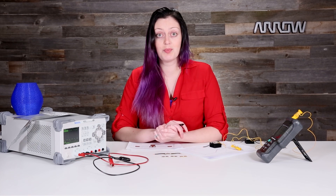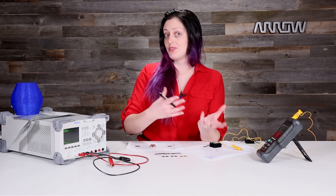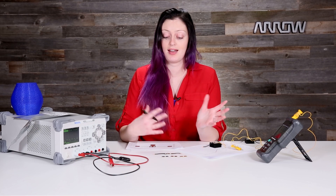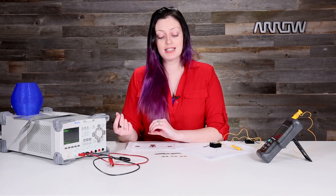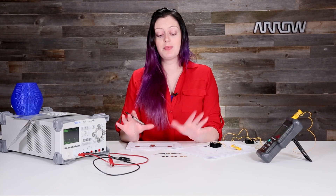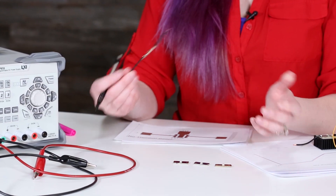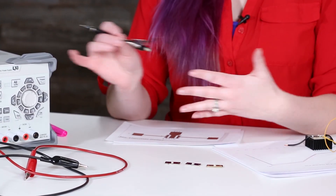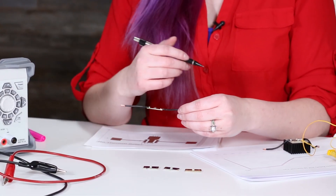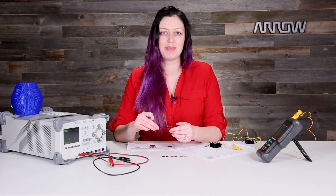I want to go over how you handle power components on a PCB. We have a couple different ways of doing it — people have different feelings about thermal vias, how much copper to use. This applies to anything like a power MOSFET that might be handling a couple watts of power, or in our case, a lighting LED. These are nice because they don't require any external circuitry. I can go ahead and test them by just applying power and ground with a current-limited power supply — a little harder to do something like a FET.